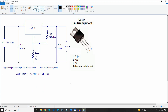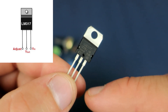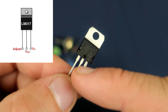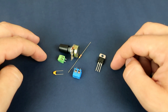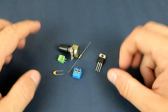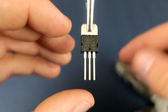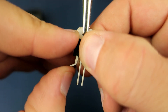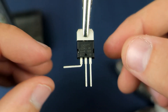Here is our schematic. It has three legs: the last leg is input voltage, the middle one is output, and the first is adjust. So if I connect 12 volts to input using a potentiometer and a couple of other components, I can adjust the voltage on the output pin. Output voltage will always be lower than input voltage, of course.